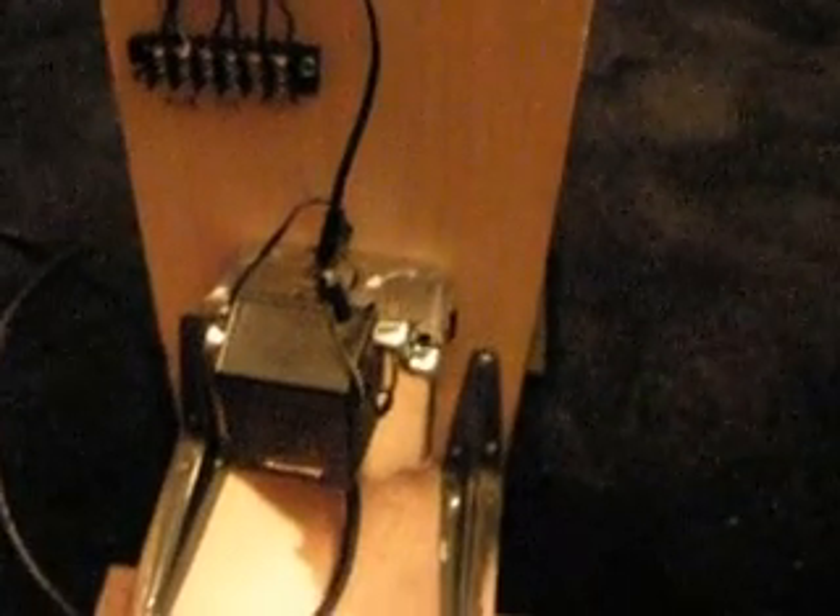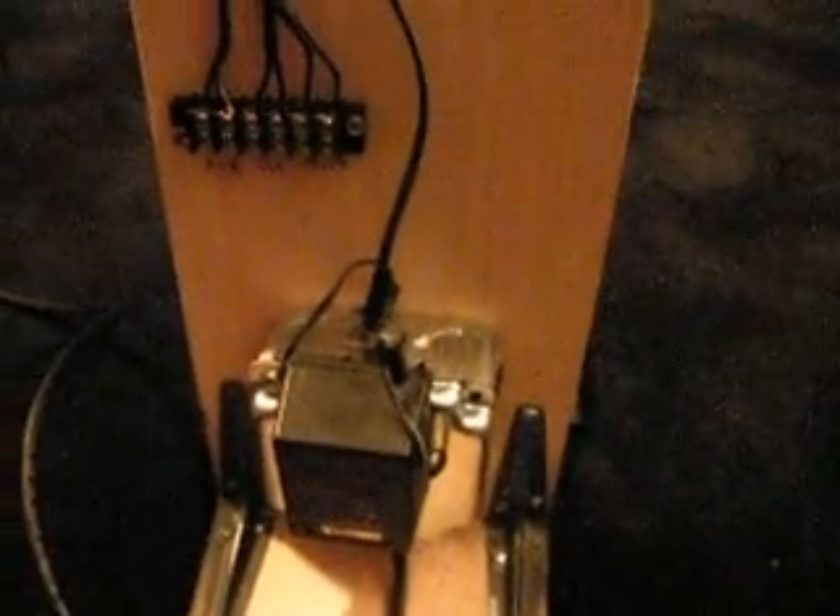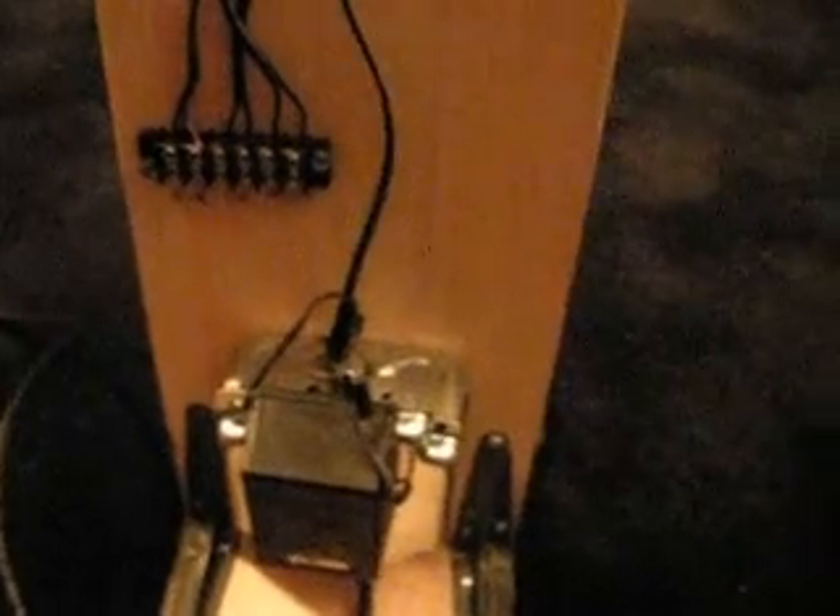There we go. And back here I get all my wiring. This is a relay box that houses the relay. And here I have a receptacle, a power outlet. The power adapter is plugged in and that's for the power for this unit. And below the power adapter, there's an auxiliary outlet that's also switched by the switch on the other side.